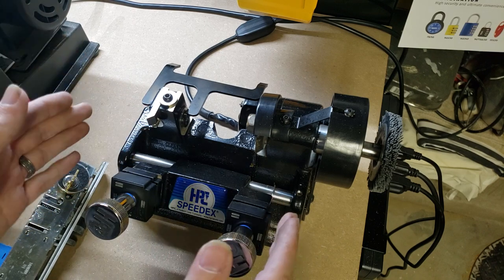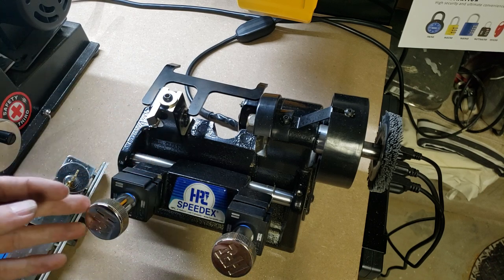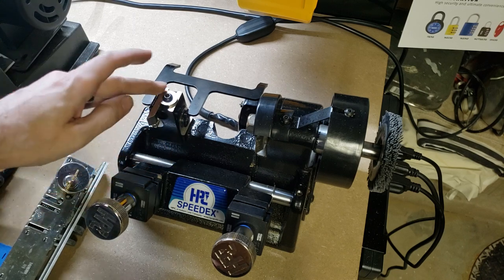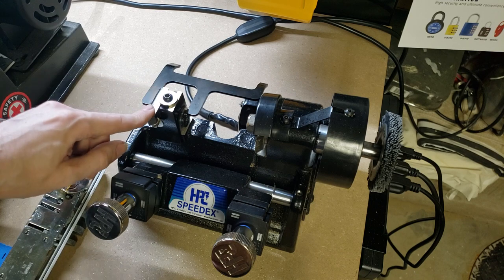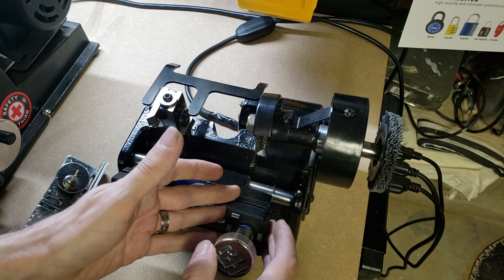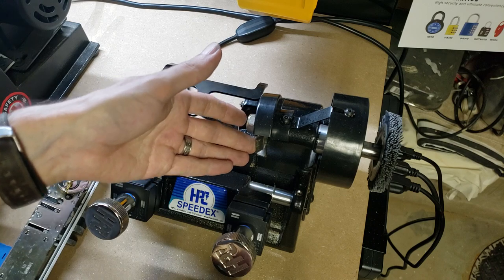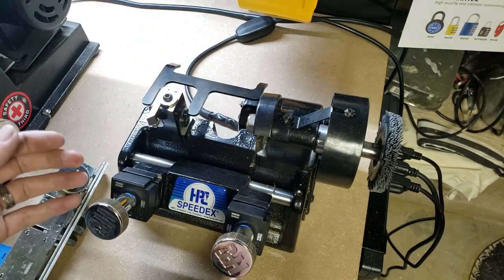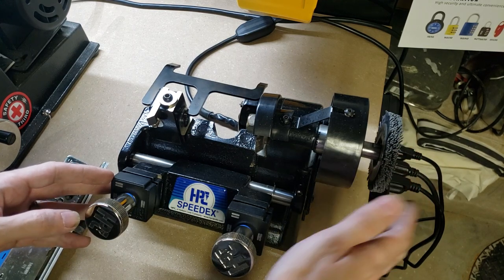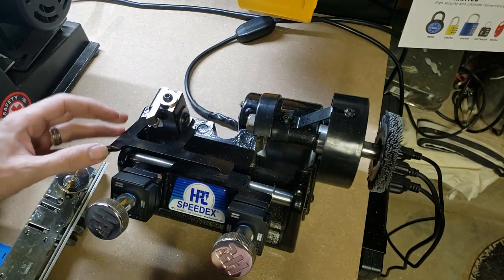That's things like Abbus and a lot of the other European brands that use a very sharp V-shaped cutter. The basic concept is that you put your original key — which obviously if you're using a duplicator you have to have — in the left-hand jaw. That will then ride against this feeler, which is going to control the depth, and in the right-hand jaw you are going to put your blank key. That will then press against the cutting wheel. You have a brush here to remove the burrs and chips, and then you have the shoulder gauge.